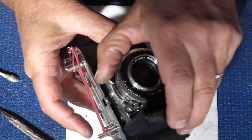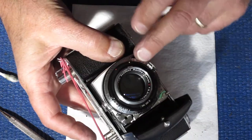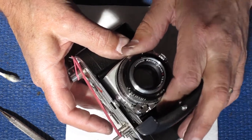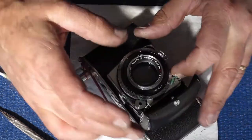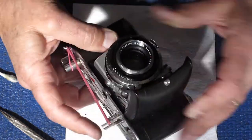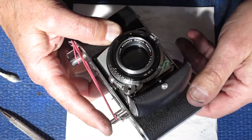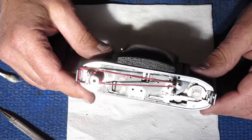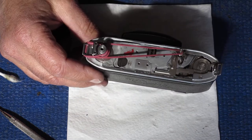Focus is nice and smooth. Sometimes you get a bit of binding, and it'll be because the shutter's not quite as centered as it might be in the holder — sometimes you can just push it across and snug up the retaining ring a bit more and it'll be good. That's it. Next up is the rangefinder.